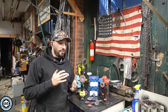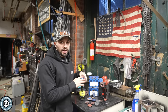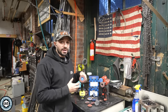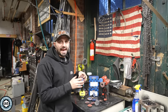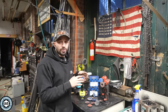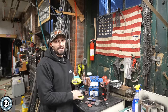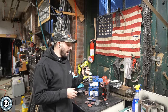These are a really versatile thing to have in your shop. You can buy the arbors really cheap, have them on a couple of different die grinders, get an assortment of consumables and they will 100% come into play on your next project. If you work in anything automotive, something like this can be so valuable when you just can't get an angle grinder into a car chassis or inside a car to grind away, remove a bung, or strip paint if you have to weld. Going up to the larger three inch size has been really great for me — I find I use the three inch one all the time, and yes, this is a cordless Ryobi die grinder that I've really enjoyed using.